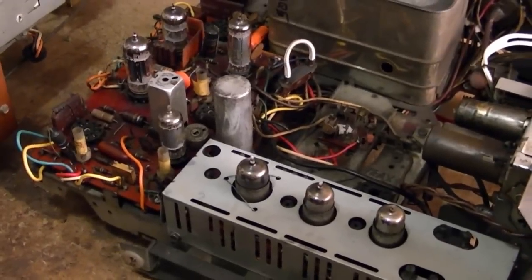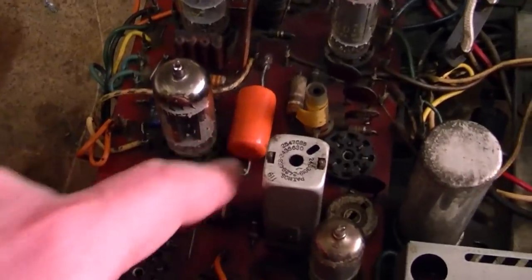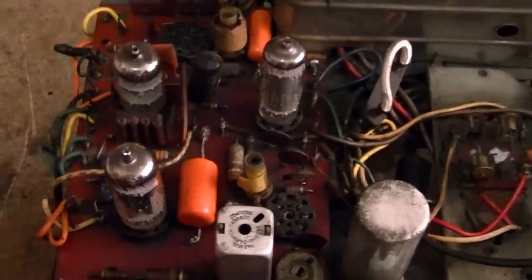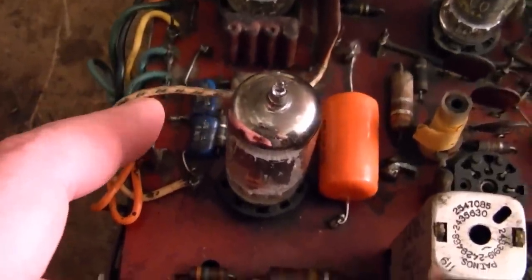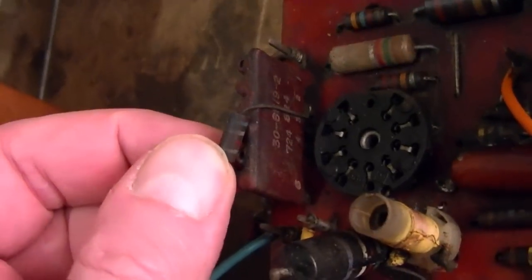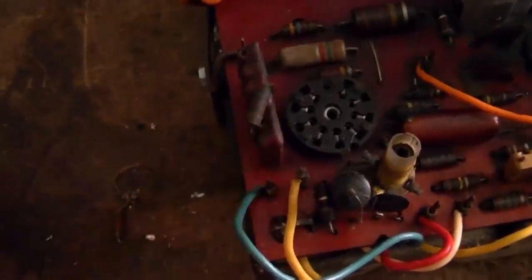So I'll start on this board and there's evidence of repairs. Whoever worked on this did not remove the board — they just clipped out a few parts on the top. Got a couple orange drops in here. This cap needs to be a thousand volts or better, so it looks like they put two caps in series to get the right voltage rating. I'll be replacing that of course. And here's something kind of interesting: this is one of those K networks and a resistor has been tacked on there. I'm curious if I pop this out and measure it — is one of these resistors so far off that somebody had to bridge it with an external resistor?